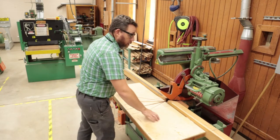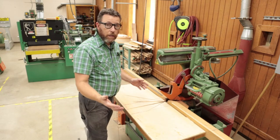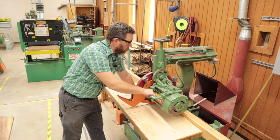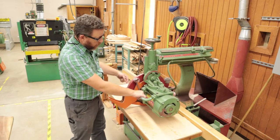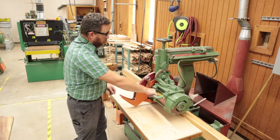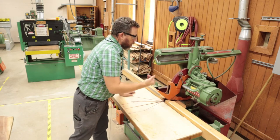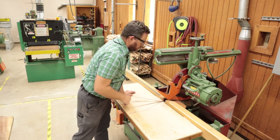All our stock goes on here, we measure up how much we want to cut off, and we always want to cut at least an inch more than we need. When holding my stock I pull this out and pull it as smoothly as possible through the machine. The blade will try to climb into the wood because of its rotation, so you need to be in control as you pull it through. You also need to be in control as it returns, because it's on a cable with a spring that pulls the whole trunnion back to the back of the machine.